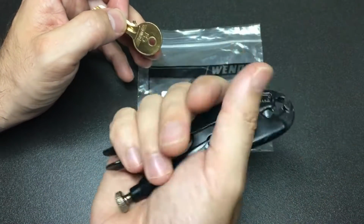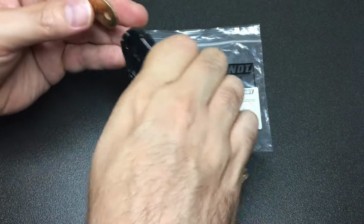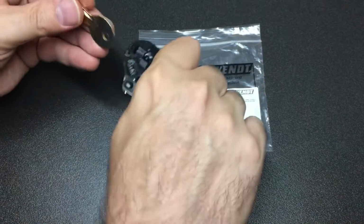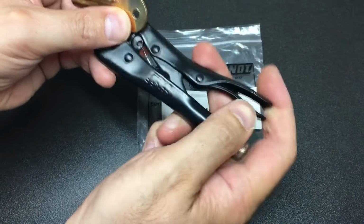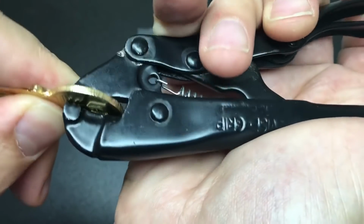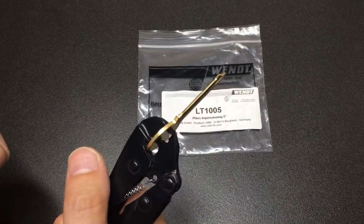So these, you can see in my hand, obviously fit very nicely. Depending which way you want to hold it, you would insert the key. If you wanted the key blade up this way, or at least if I'm in my right hand, and if you wanted it down this way, it's the mechanics of how you do it. So let's have it so that the key blank is blade up, like that. And these differ from those pliers because it's got an extra contact point here. You can see how that inserts into the key ring hole on the key and provides a point of, I'm not going to say triangulation, because there are three contact points, 1, 2, 3, on the key blank. And then you snap it.